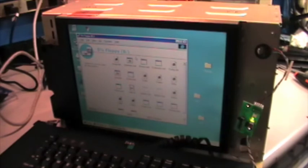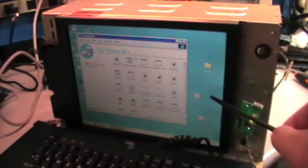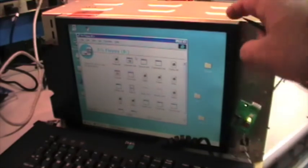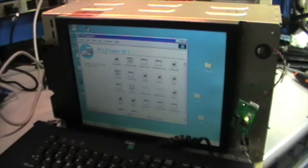So I suspect that I'm having a similar problem on the hard disk drive, so I will try to fix it. Another problem is, of course, this monitor. I'm not sure that you can see, there are some darker areas here, so the brightness control is at the maximum, and seems to change a very small amount. So perhaps I think there is a CFL tube that gets the backlight on this screen. So this is another issue that I wish to fix.